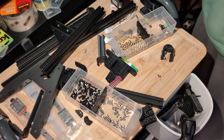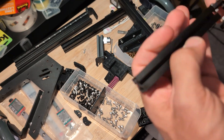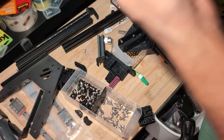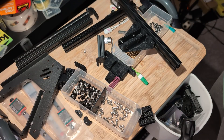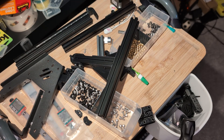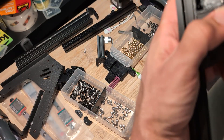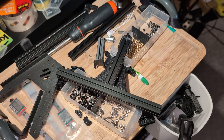Pretty much all Tri-Zero builds that I've seen use some sort of bed probe for tilt adjust and bed mesh. There are a few different designs out there — most of them are designed for the Voron V0 and also work for the Tri-Zero. I am not going to be going with any of those, not because they don't work or aren't good, but I personally don't like the type of probe that you pick up and drop off. I have been using the Mellowfly Alps pressure sensor and I've liked it so far.